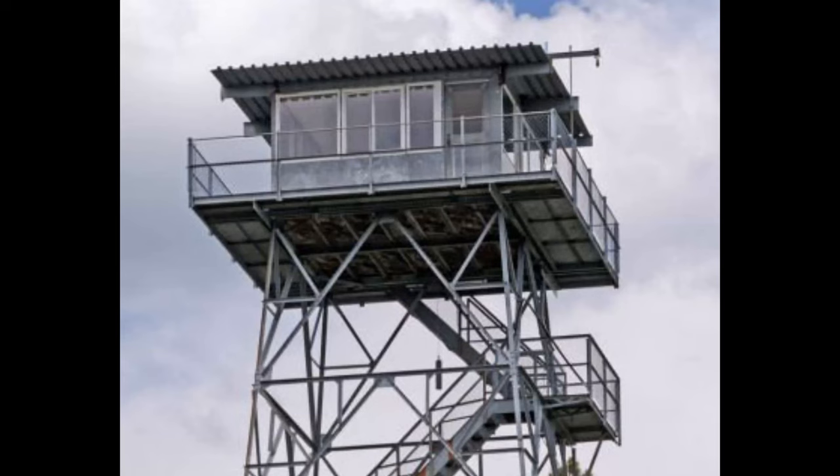This comes down and sits on some concrete pylons that are a little narrow at the top compared to the bottom. I don't know what kind of footer this really had — the picture shows them about two or three feet tall sticking out of the ground. From working on commercial steel buildings, I know that a five-floor steel building's footer is 16 foot by 16 foot by 16 foot with a lot of iron in it to give good structural support. I decided to make each of these main sections 10 foot tall, making it 50 feet up to the floor of my tower.